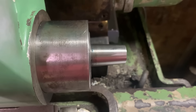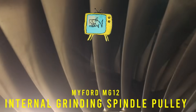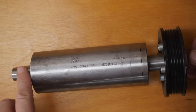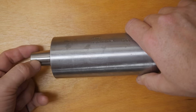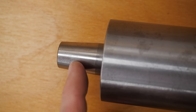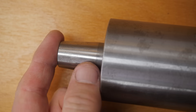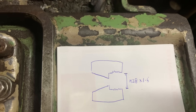We need to make a pulley for this internal grinding spindle. Luke's internal grinding spindle is similar to one of these cartridge spindles and has a tapered attachment to the shaft for the pulley. Unlike my setup, Luke had the foresight to design it with a taper and also put a thread on the outside portion of the pulley so you can easily press it back off. That thread makes this difficult to do on a manual lathe.